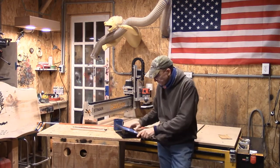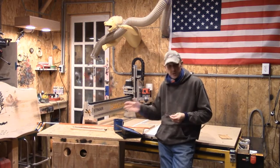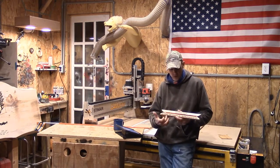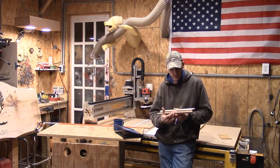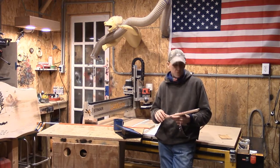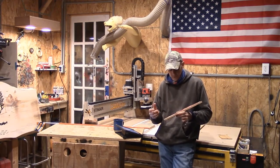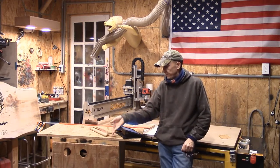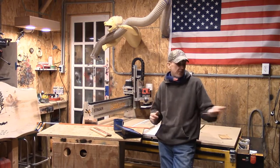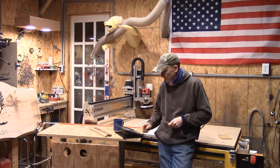Design and fabrication — like I said, these were designed to lay flat. I'm not going to give you a full computer walkthrough. We did provide three downloadable models with different ends, but it's up to you to put in your name or, if doing these as gifts, the individual's name, address, town, and state. It's a very simple program. I used a 90-degree V-bit for the track in the middle where the fishing line sits, a quarter-inch end mill, and a 60-degree V-bit — just three bits total. As far as materials, literally scrap wood from the wood pile for the stove.